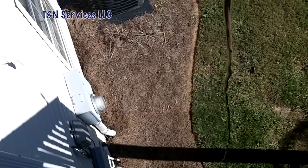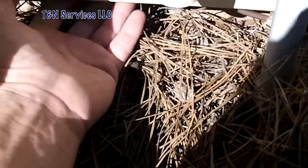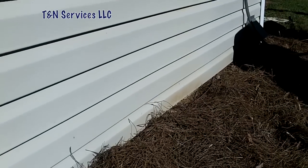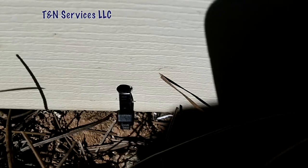Thermostat wire is down on the ground now. Now I'm going to get it all tucked in. Got the thermostat wire tucked in behind the corner piece there. To ensure that the thermostat wire stays up, I'm going to drill a hole in the side in there, take my tie strap, run it through the hole, and tighten it up. Do that in four, five, six places along the wall. That thermostat wire will be behind the siding. When you get it done, the siding has a little lip on it that the thermostat wire will set on — drill your hole about a quarter inch above that lip, set the wire on the lip, put your strap in there, tighten it up, and it'll hold.